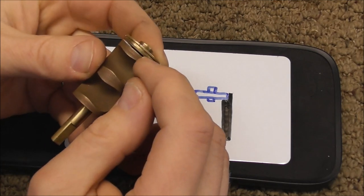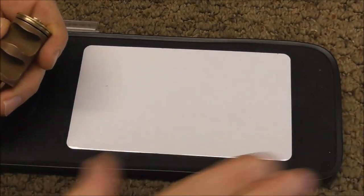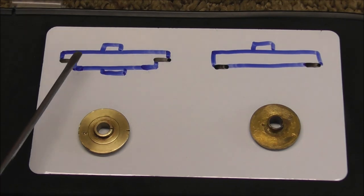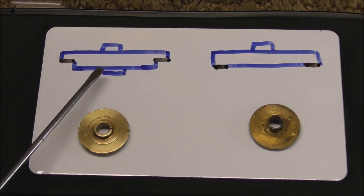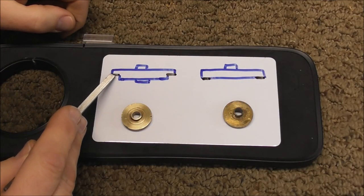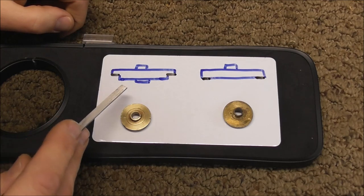The way you do that is by filing down the shoulder of the bearing plate. The metal you want to remove is the shoulder portion, and you do that with a small file. I'm going to be working on one type today, but the method is almost the same on both. Be very careful just to get the shoulder — do not file the blue part, because that will make the bearing plate loose inside the rotor and it will fall out easily.